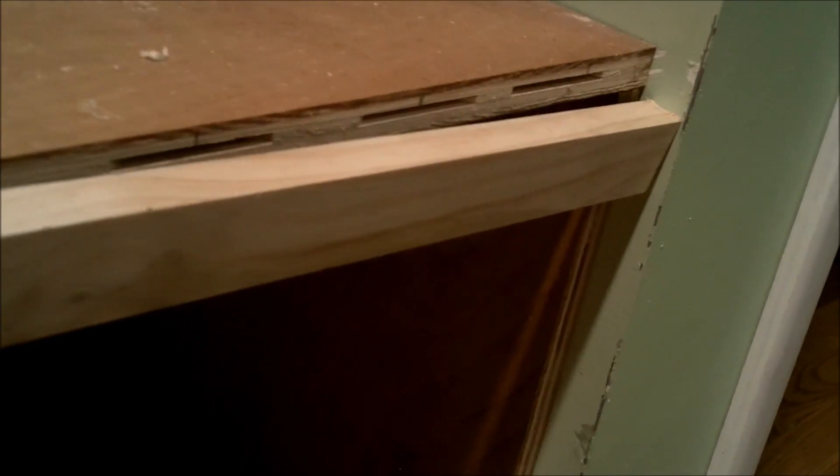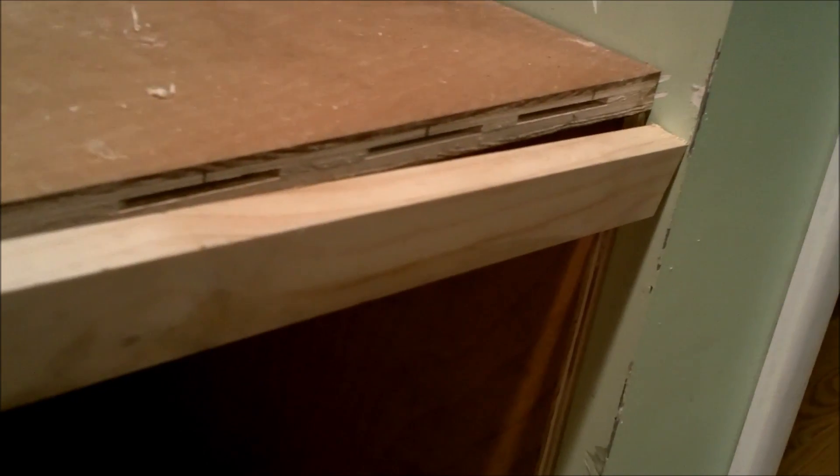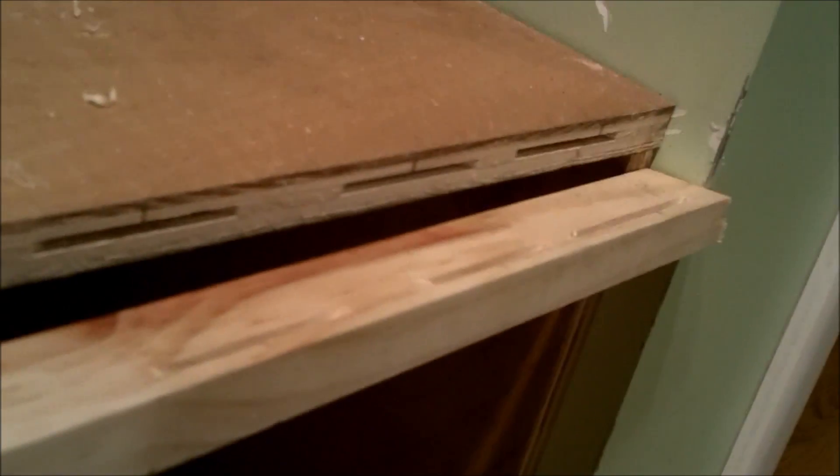Down here I'm going to be putting a whole bunch of biscuits in, and you see those little notches that I cut. I spaced them really close over here because the bench actually goes a little bit, but then it's pretty straight later on. The board I'm going to use to cover up the plywood is nice and straight. It's gross because it hasn't been stained yet — that's the next step. I put some biscuits in here; I just laid out from the right edge a certain number of inches for each cut, got the biscuits sliced in the holes. You can see they line up nice and pretty.